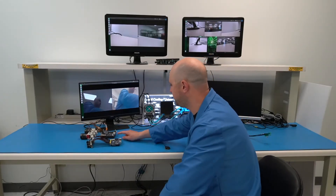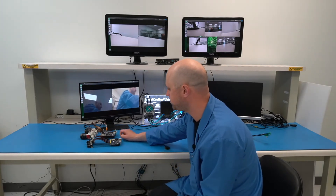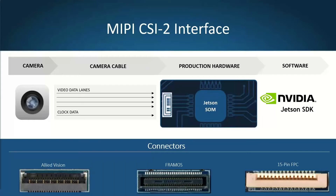This camera add-on board can actually accept up to six cameras for simultaneous streaming as well as a synchronization configuration. An obstacle often introduced with this interface is the physical length of the interface connector or cabling scheme. Most vendors will often supply a MIPI data cable, which usually has a maximum length around six to 12 inches, and each vendor typically uses a different physical connector, so there is no standard between these MIPI connectors.